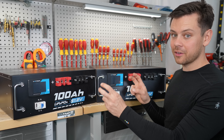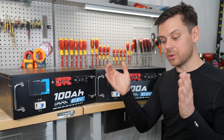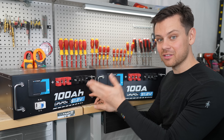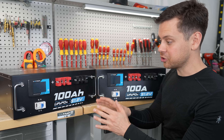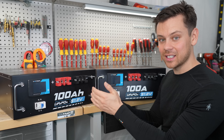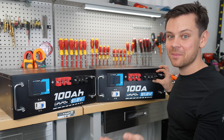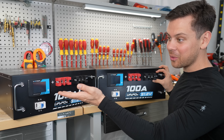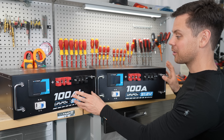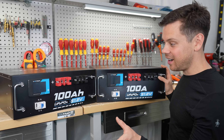Now, the more fancy server rack BMS with communication has a coulomb counter, and it cycles with 100 amp hours available no matter what. This one is different — it uses voltage to determine the cutoff threshold, which is totally fine and doesn't hurt anything. The capacity figures are consistent every single time, which personally I like because I test multiple batteries and I get the same number every single time. When I'm testing the Eco-Worthy and it gives me 104, 98, 101, 99 — it pisses me off. For most of my tests, I like to get within 0.1 amp hours every single time.